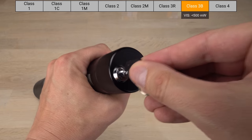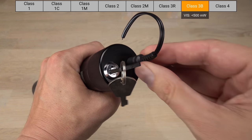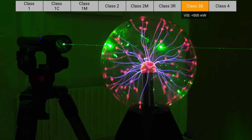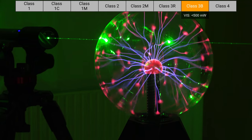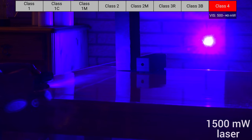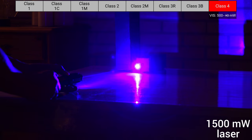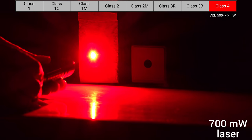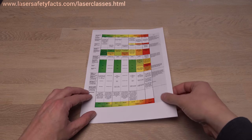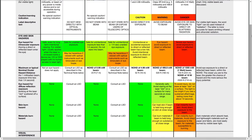These lasers must include both a safety interlock and key switch. They are not safe. Any hit from a direct beam or specular reflection of it is hazardous. You have to wear safety glasses. Class 4 is the unlimited class. Even diffuse reflections of the beam are an eye hazard, and the lasers are strong enough to start fires. A lot of precautions are needed. My highest powered lasers are in this class. For more details and guidance, I have linked to a PDF document in the description.